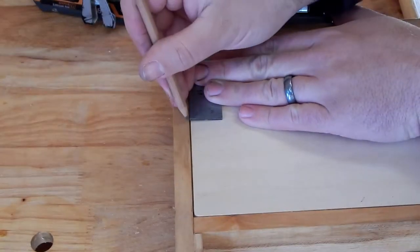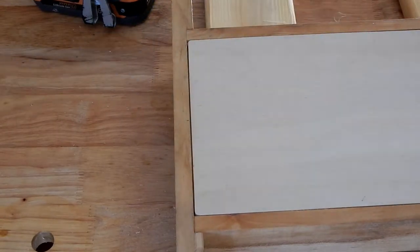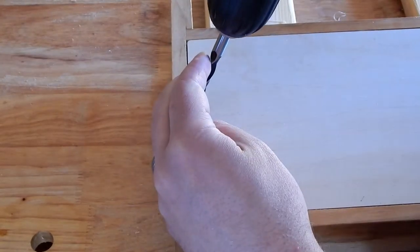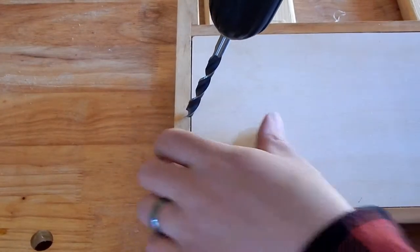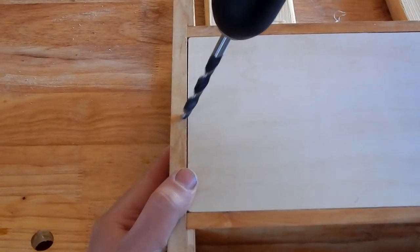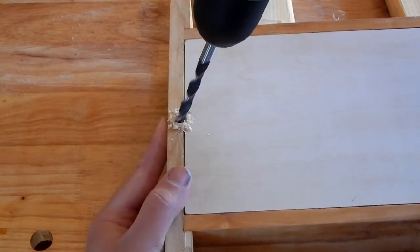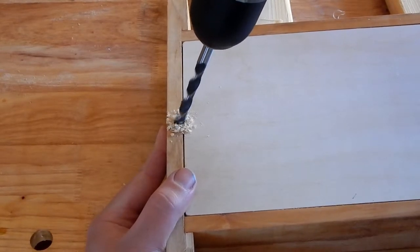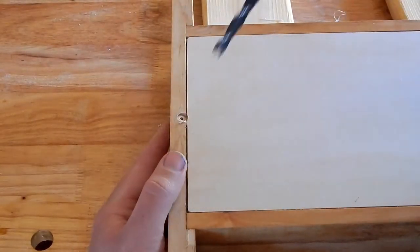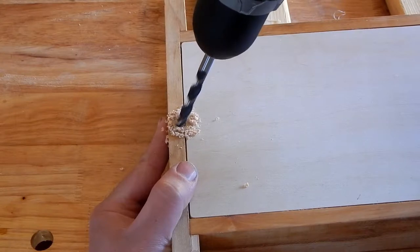While those magnets dry, it should be fine to drill our holes for hanging. Now here's my first major design flaw with this project: I've only put one hole in here for a nail. So when the door opens, the center of gravity of the cabinet changes and it wants to tilt. For your own project, put two holes spaced about a third of the way in from either edge so it can't tilt. Or use a piece of 1x3 for a French cleat system. Commercially available picture hangers would work as well.